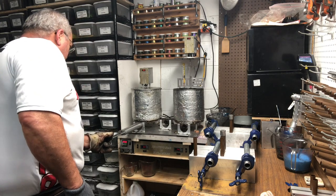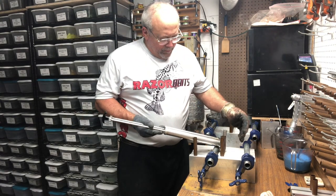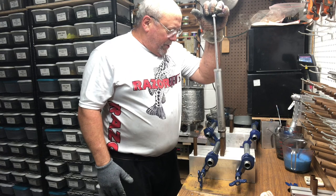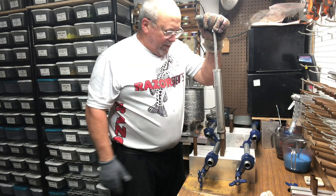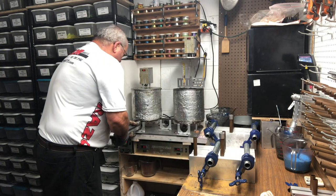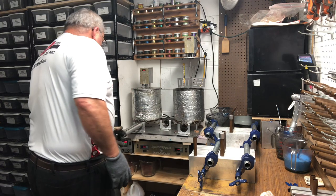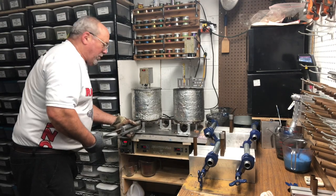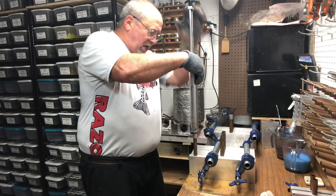Okay, refill the injector. Come back over, apply a little pressure, pull the Bear's sprue extender up, inject, pinch, separate the sprue extenders, put the Bear's on top again, shoot, and separate. I got another bulb here. That's the Bait Junkie 10 and a quarter inch bulb. And being that I've only got one, I'm shooting it with no color tail, but I'm shooting it the solid black with blue glitter, so I can build an inventory of that until I get my 12 or my five other molds from Leonard. Okay, put the Bear's sprue extender on top of my sprue extenders.